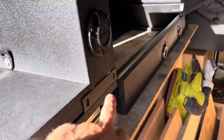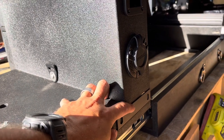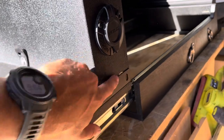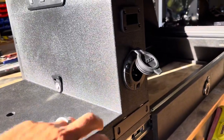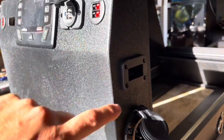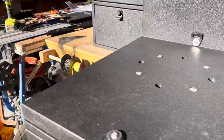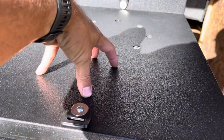The latching is done by magnets. I recessed one-inch neodymium magnets — two magnets is actually overkill, it's very strong, could have used just one. Right here we have the NOCO plug — this is for shore power — and then this is the 50-amp solar input. It won't actually be 50 amp, but he can put a 100-watt or 200-watt panel and it'll connect directly to the Manager 30. This is all wired up, and we have heavy-duty mounts that will keep his box mounted to the actual platform.